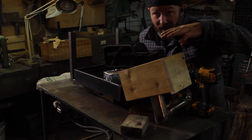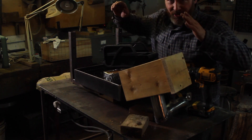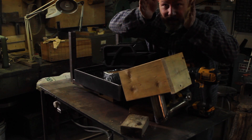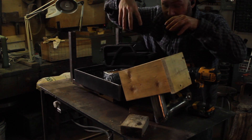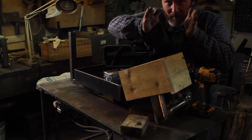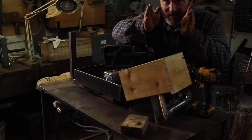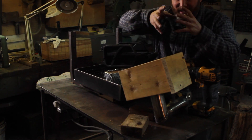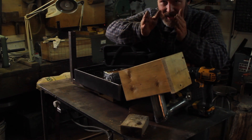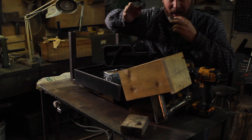Critical moment. As I build this, I have to make sure that it is not tapering out, because it won't fit into the recess in the cover of the forge. So I'm creating it so it's just tapered in a little bit, so it has a better chance in case things do shift or open up — hopefully it doesn't though. It's just kind of a slight wedge shape.